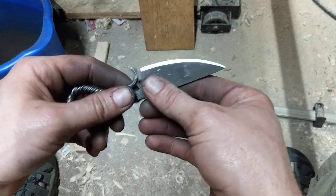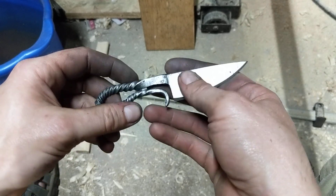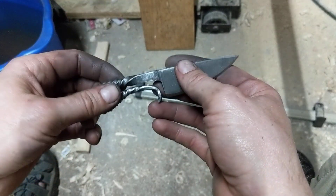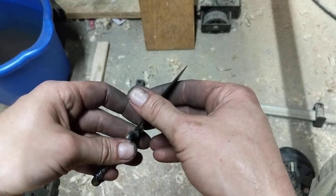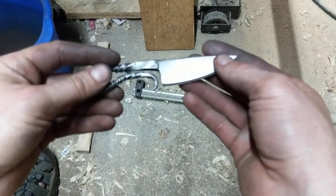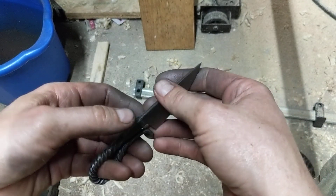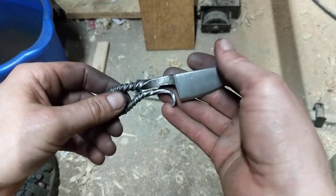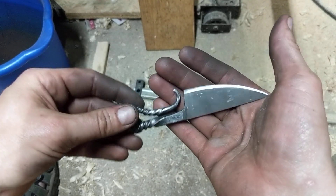It's most sensible on a propane forge because you get a good, uniform heat across the whole piece. If I did it on my coal forge, I'd have a very localized hot spot and wouldn't have uniform heat across the whole thing, and it wouldn't be as convenient to have other forging work going on at the same time. Propane definitely has an advantage there. Of course, if you've got a heat treating kiln, that's even easier — you can fire that thing up and leave it while you're doing other activities in your shop.